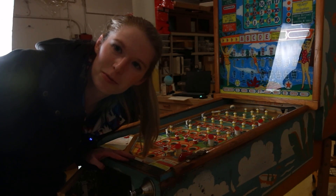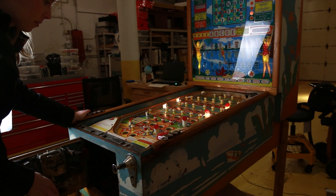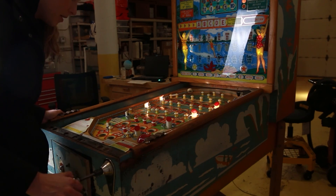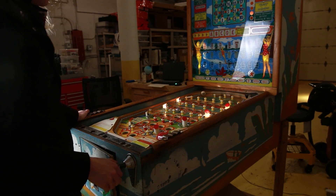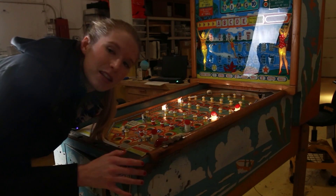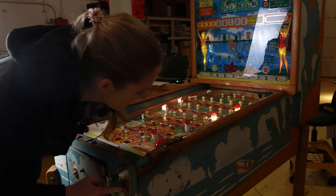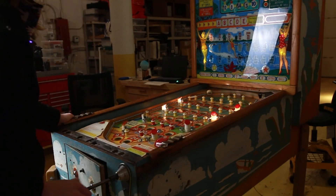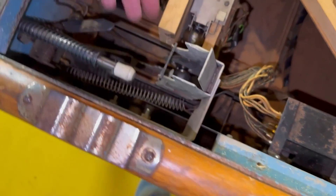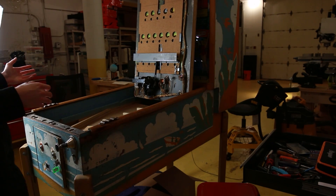I recently got a tetanus shot — I think that was a good idea before working on this. I heard the sound of a ball loading, so let's reset the game. A ball came up but the shutter didn't close, so if I play this ball it's going to cause issues. The shutter closed. The ball is struggling to come out of the hole, which makes me think something happened with the spring when I was dropping balls onto it. The ball assist button down here helped. The lift mechanism isn't coming up high enough, so I literally just pulled the spring further in so it's a little bit more in tension. Let's see if that works.